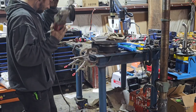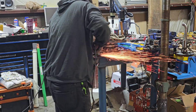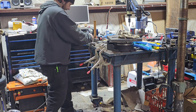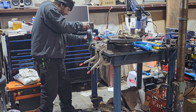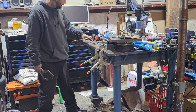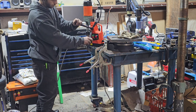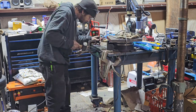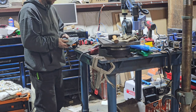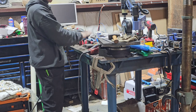Let's give these a quick little grind. We're going to use the wheels for the toolbox to mark out the mounting holes. We'll drill up this one, make sure it fits, and then use this one to mark the other one. Now with all the plates made and drilled, we're going to cut the bolt holes off of the old wheel feet so that we can weld these to the plates and then bolt them to the toolbox.